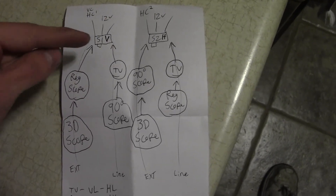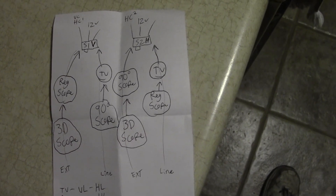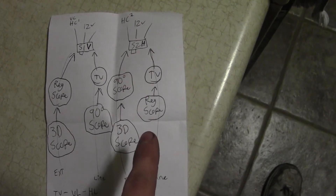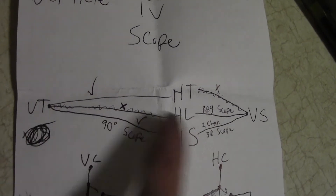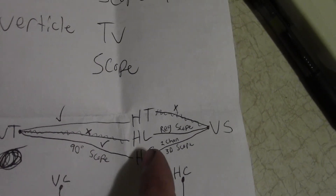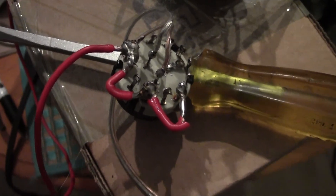The wiring diagram is shown here — pause the video if you have questions. If this paperwork doesn't make sense to you, you probably should not modify the design. Here are the two switches across power and relays: switch one is between two relays, switch two controls one relay. This also shows you exactly which switch position you want for each function — for example, for 3D scope both switches go to the on position. This is why you'd have a conflict with three switches — certain combinations could nuke things, connecting both coils across a single high-frequency power supply, likely producing smoke.